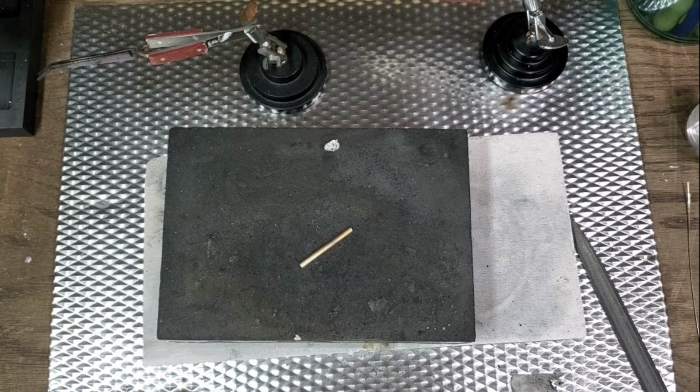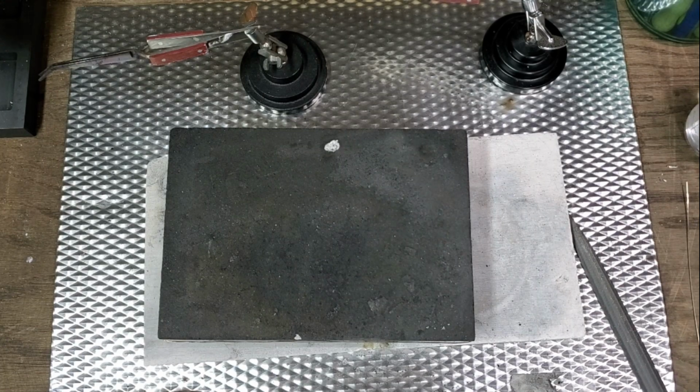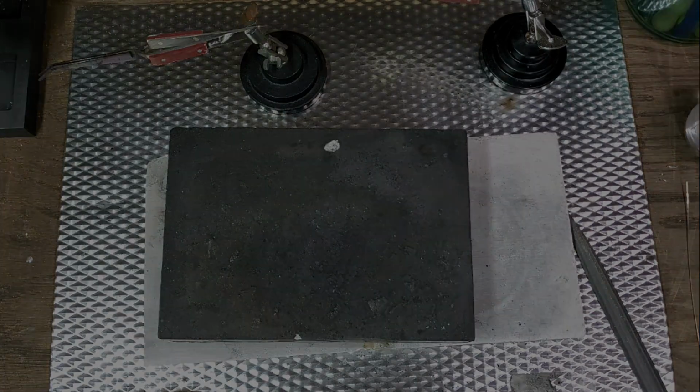Once the piece is annealed, you can just quench it in water and then pickle it for a few minutes. I've shared what I use for a pickling solution in previous videos, but the recipe that I use will be included in the description.